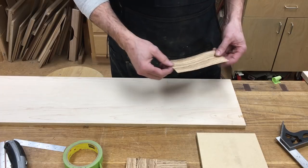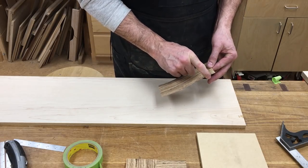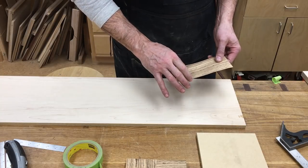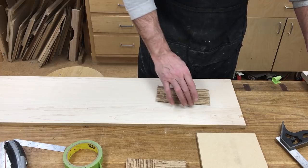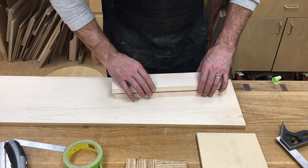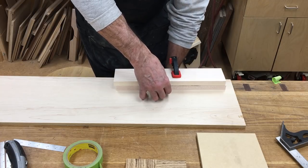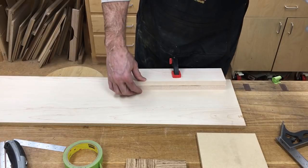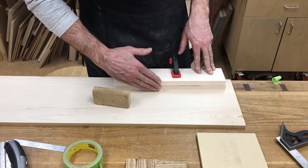I've got a little bit of veneer left over from this process. I've made a strip long enough to get all four pieces I need out of it, with both edges trued. The width is roughly three-and-an-eighth to three-and-a-quarter — oversized from what I'll need in the final product. To true the edges, I use two pieces of hardwood with a flat edge, clamping the veneer between them with just a bit protruding, then running a sanding block back and forth along the edge until it's perfectly flush.